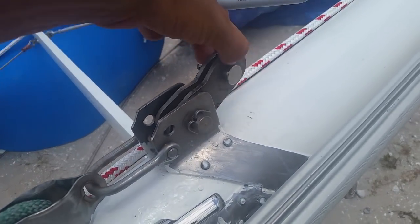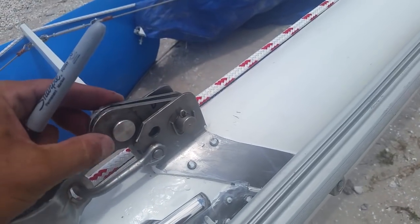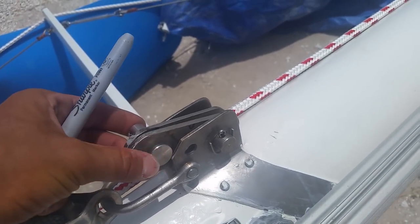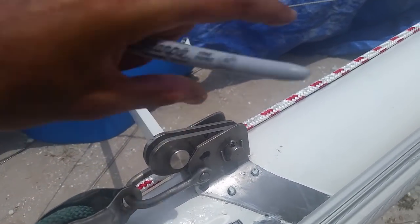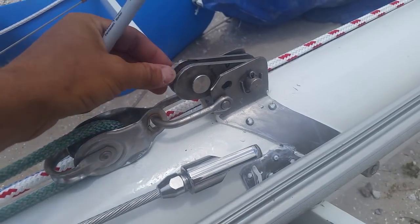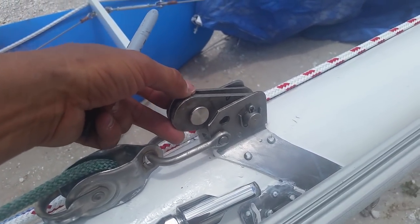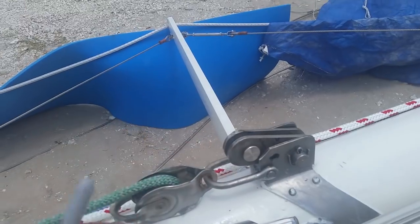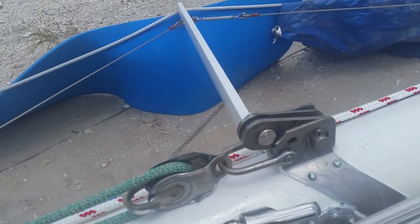So I've cut that out a bit, but I'm not sure I've cut it out enough. When this was down — see how I've cut these corners off — this pin was actually rubbing on that. Heavens forbid, if there was such force there and that was a little bit over this cotter pin, it could have sheared off. Then I wouldn't even have a cotter pin to hold this pin in. I've got to make sure this is not sitting hard up against that shackle pin. So I'm going to use similar triangles to make sure the angle is enough to get to the chain plate on the deck.